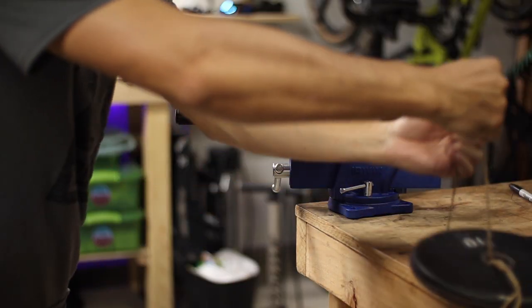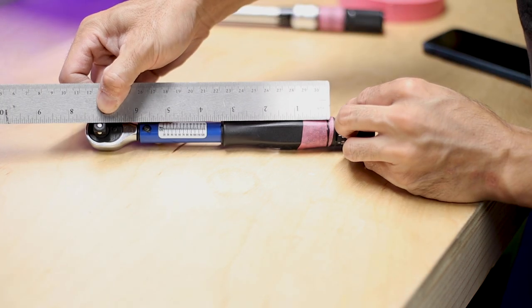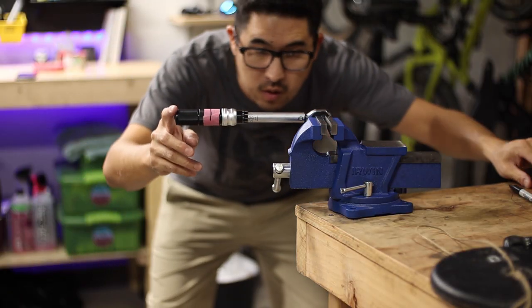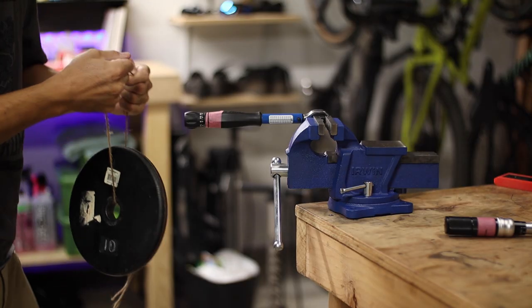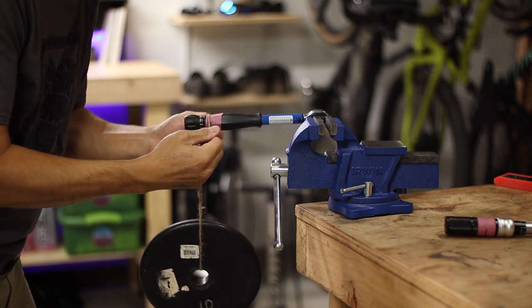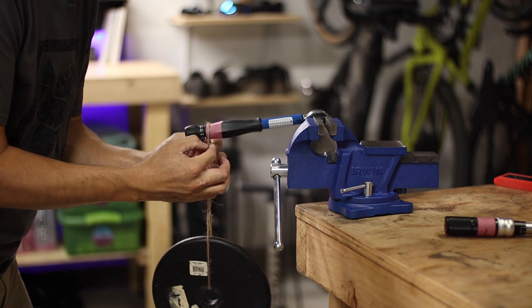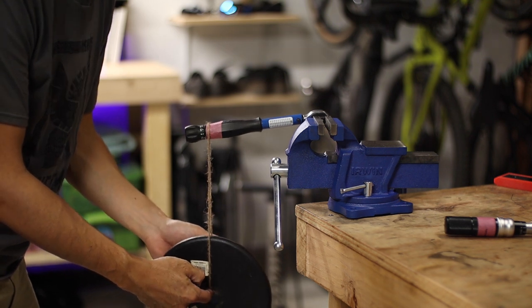To test accuracy, I have a pretty crude but logical setup: a mark on the handle of each wrench that's exactly seven inches from the axis of rotation. Carefully clamping the wrench into a bench vise as horizontally as possible, I can then hang a 10-pound weight at that mark. By definition, this represents an applied torque of seven times ten, or 70 inch-pounds, or in other words, 7.91 newton meters. In the case of the Park Tool, which is set to 8 newton meters — basically as close as I can get to 7.91 — when I apply exactly 70 inch-pounds, it actually clicks, which is a bit alarming, since it should take a little bit more than 70 inch-pounds to get it to click.